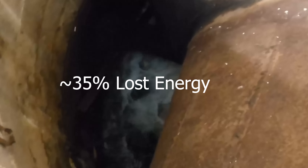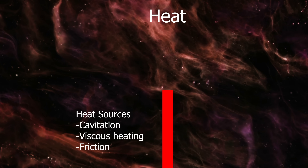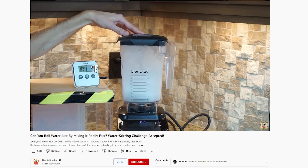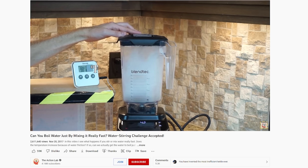This is because there's a lot of swirling fluid moving around in different directions, and whenever you have fluid rubbing against itself or the walls of a container, you're going to generate some heat. You can see this happen in a blender when you just swirl around water really fast — the temperature increases. So the energy that you could have turned into useful work gets wasted as heat.